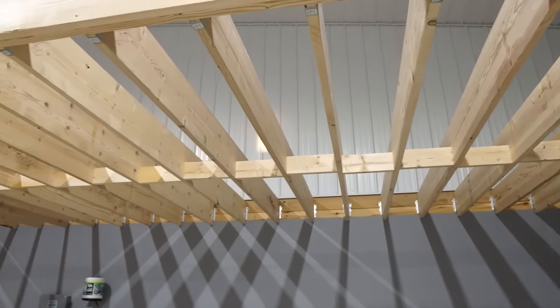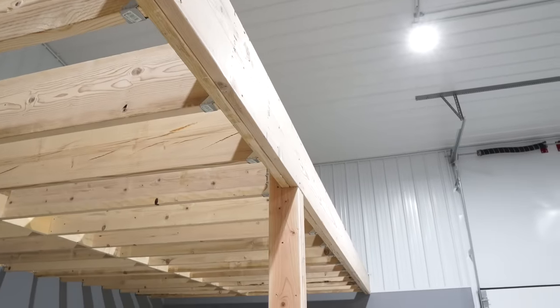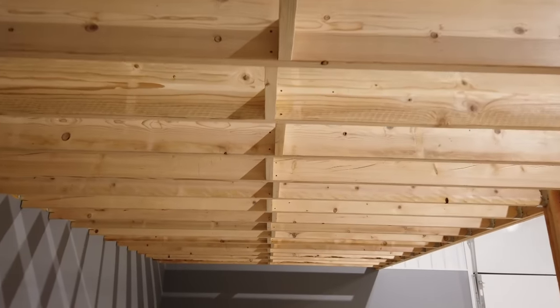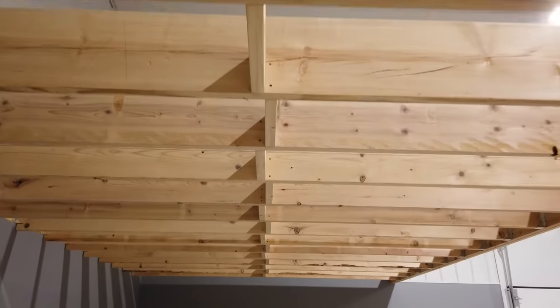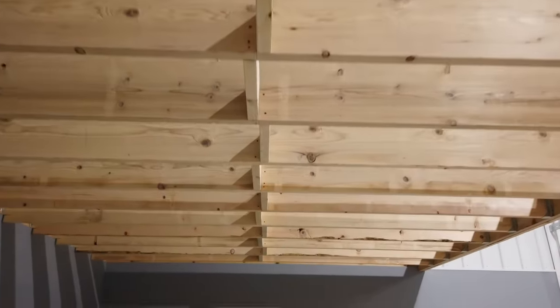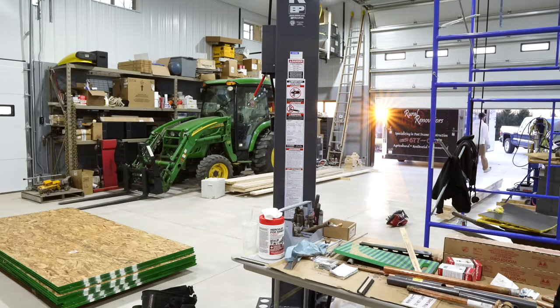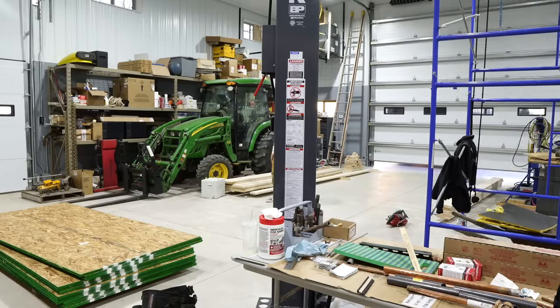Concrete must be good. Well, there you go. We got all the floor joists installed. We got the main frame cut up, and we just figured out the stair stringer, how that's gonna work. Got all that math figured out. So tomorrow we'll come back. We'll start laying out our floor system, which is a tongue and groove OSB sturdy floor. And then go ahead and cut up all of our stringers, start making our treads and risers, and put together the stairs. So, yeah, we'll see you in the morning, which is gonna be like as soon as I am done with this clip, which is awkward.